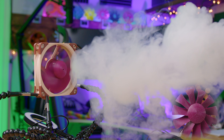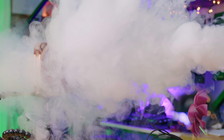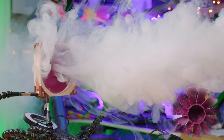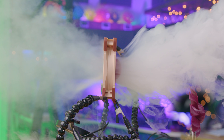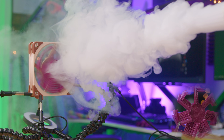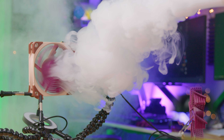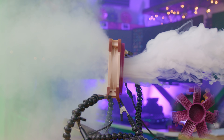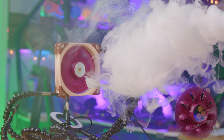On to the Prandtl. The Prandtl seems to be performing exceptionally — almost all the air flowing towards the fan is gobbled up and accelerated out the back, and looking at the side it's clear the air is being handled very well with a reasonably tight flow out the back. Things get a little more squirrely with the cheese grater. The air is still being drawn in and accelerated, but it doesn't seem to be doing so very efficiently. That tight flow the Prandtl had is all gone — the cheese grater throws air out in a very wide, wide cone.